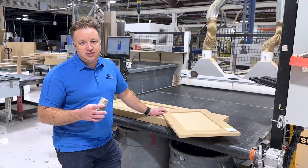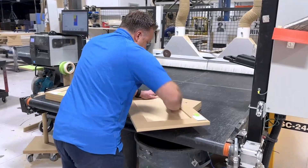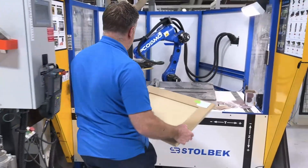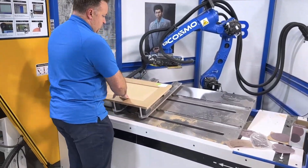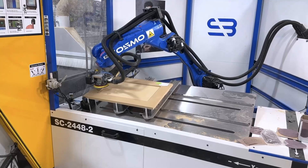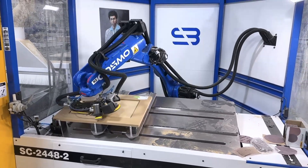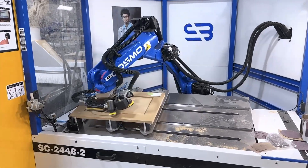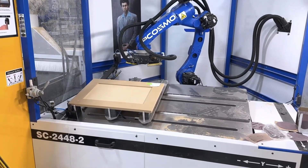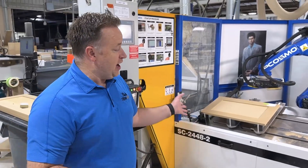So we're lucky to have been able to automate this process. We do things a little bit differently — we grab them off the CNC. First thing, get them with a quick sponge. And then we're going to put it on Cosmo. Suck it down, make sure our vacuum rim's good. Cosmo's going to run automatically — it's going to measure the styles and highlights of the door and then go in and sand our panel. As it's done, it blows off the sandpaper. The great thing about this is our door's done now. While the door is running, we're just touching up our other one, doing the sanding, and then we rotate the door out.